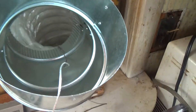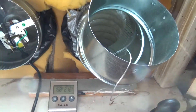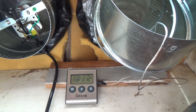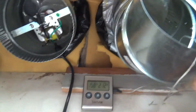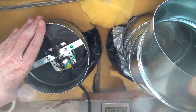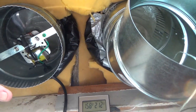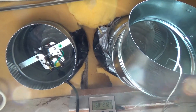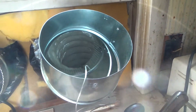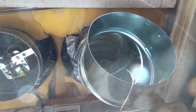Going out of the pipe you get a lot more air than you do with the small fan, and the airflow ratio is better. When this is actually set up, the return vent here will go on the north side of the house, pulling cold air in from the north side and blowing it back in on the south side where the heat is going. That'll create a draw through the house to get the air to circulate more.